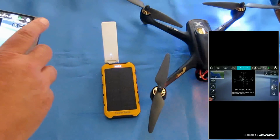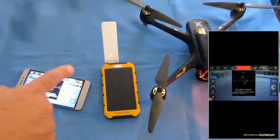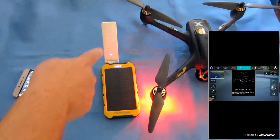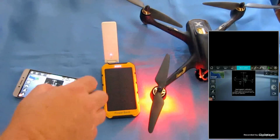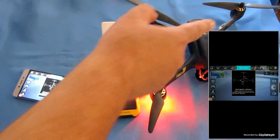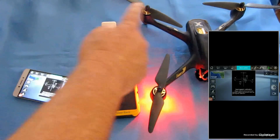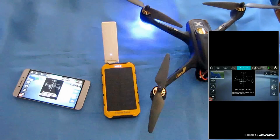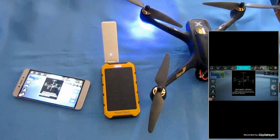It's showing the blue screen, the repeater worked, and now it's asking me to do the geomagnetic compass calibration. That's how you do it folks. You want to do this at home the day before you go flying, because once you go out in the field it will remember the setup — you don't need to do it again. All you do in the field is turn on the quadcopter, plug in the repeater, it automatically connects, then you connect to the repeater via Wi-Fi and you're ready to go with your quadcopter's app.